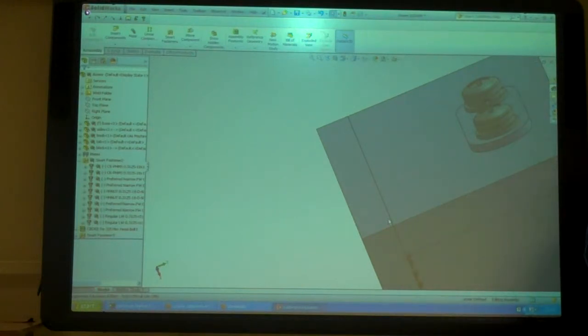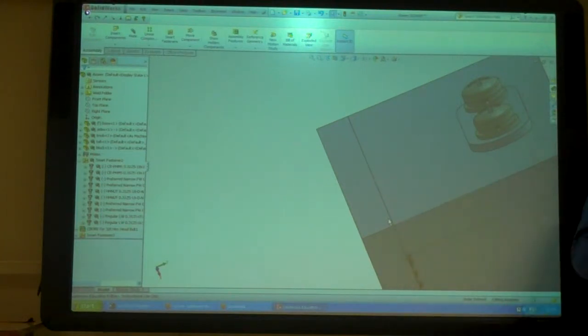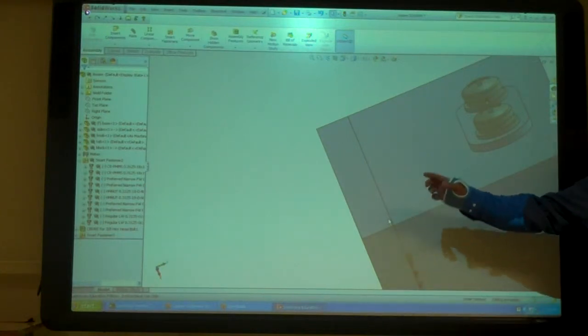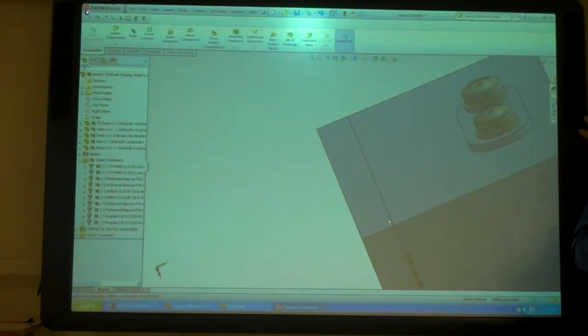Right. And usually we wouldn't put that on the part drawing. Usually that'd just be here on the assembly. We'd call it the weld and the machinist would know, or the welder would know, I need to grind that off, then fill the weld. So we don't want to go into the model and put the chamfer on the model, because that makes the drawing for that, and we don't want to show that chamfer on that drawing.